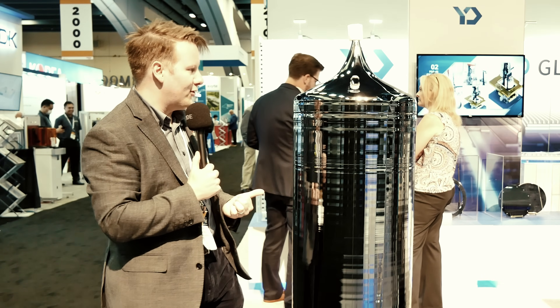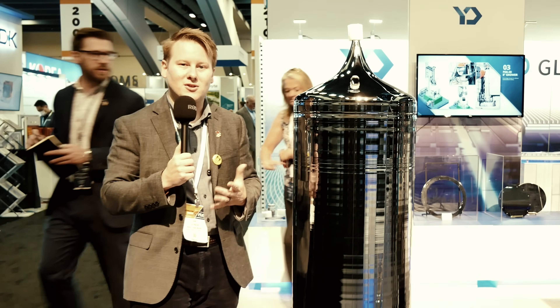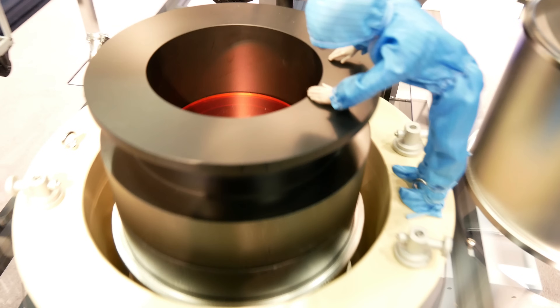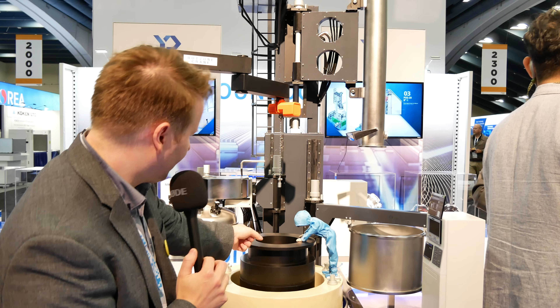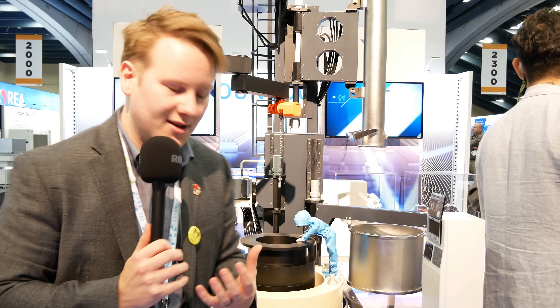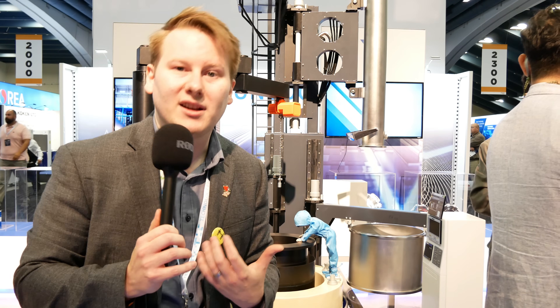Anastasia, I think there's a fair few extra wafers here for you to break. But the machine itself that they use to create these sorts of things — well, they've got a mock-up of exactly what that looks like. So this is an active trade show, there are lots of people around me. This company is obviously looking at customers and enthusiasts like myself who are interested in this sort of thing. So the idea is you have this crucible in the middle where you have your crystalline silicon, you melt it down, use a seed crystal, and then you pull it up very slowly, very methodically, very mechanically — because you need your wafers to be consistent, the right size. And let's just say it can be very expensive if it goes wrong.